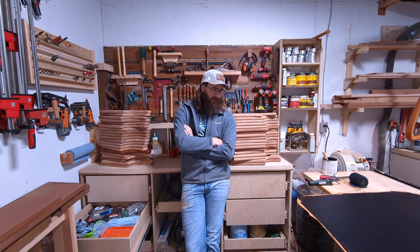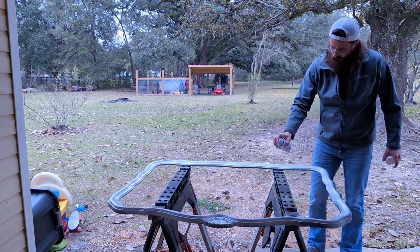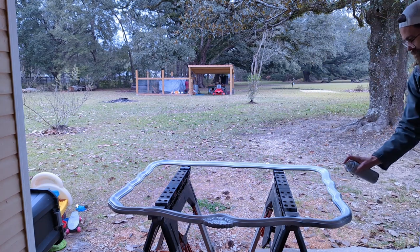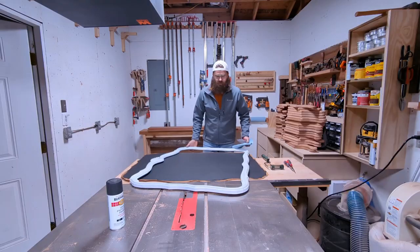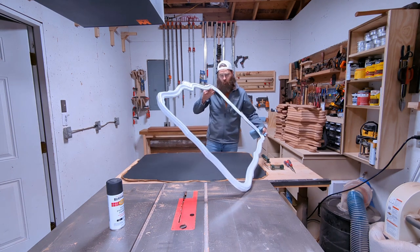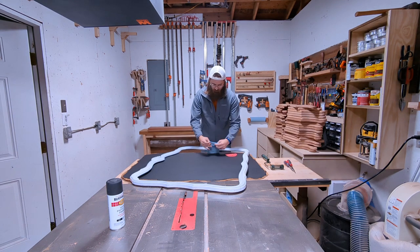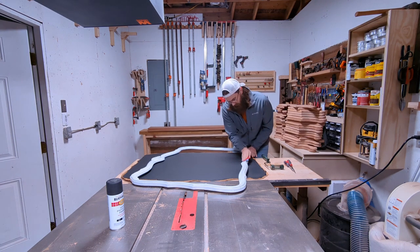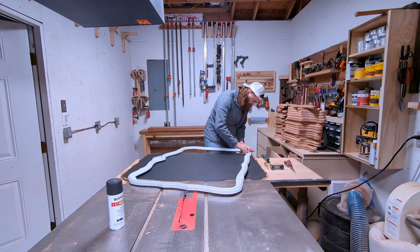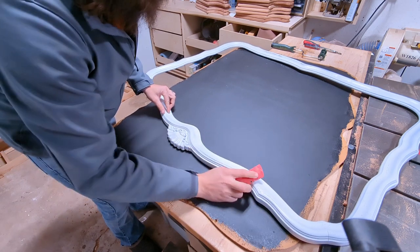I think I'm going to call it a night — it's pretty late. I'll see you in the morning. So we painted the frame black, then came on top with a coat of white after it dried. Now that the white has set up long enough, get some 150 sandpaper using the same trick as earlier — sand again, but try to bring some areas down to the black coat underneath. Where it's really going to pop is areas like the raised details — you just want to barely hit those.